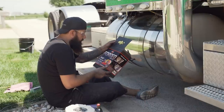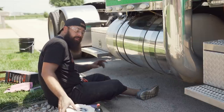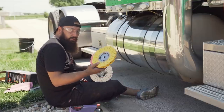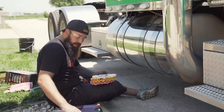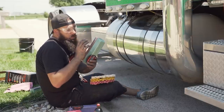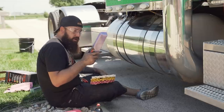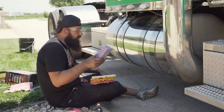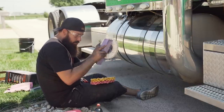We just opened up the forged kit to see what's inside — it's a little more than the aluminum mini kit. You get three buffing wheels instead of two: the heavy cut orange one, the medium cut yellow one which we've been using, and the white one which is a fine polish. It also comes with rags, applicators, the green and brown compounding bricks, and then an extra purple one which is a fine abrasive — what they call a show polish. We're going to see if we can make this look like a mirror using the white buffing wheel.